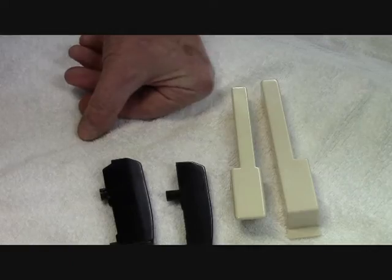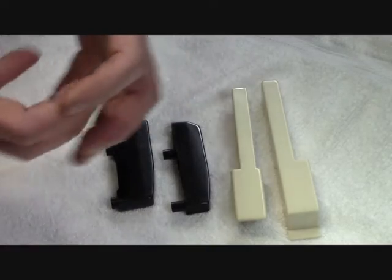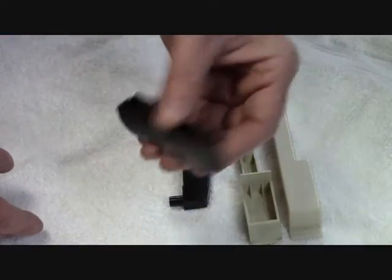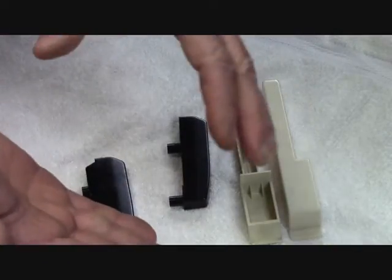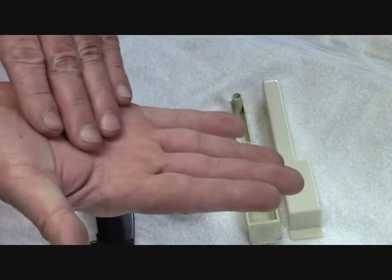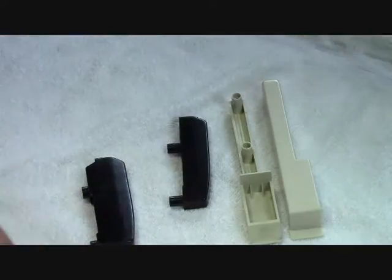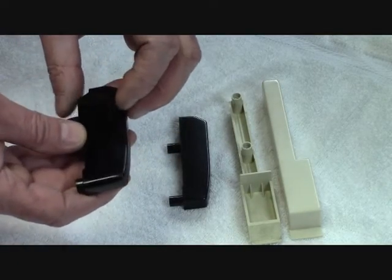The difference between the manufacturing processes is that a thermoplastic material uses a cavity mold — the reverse of the part — where plastic is injected into the mold. A thermoset mold is two halves that come together. They pour a powdered material in between those two halves, and with heat and pressure it melts and forms the parts. Once it comes apart, the flash is ground off and you have the finished piece.